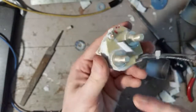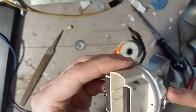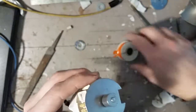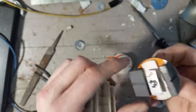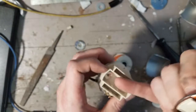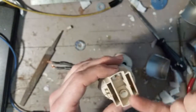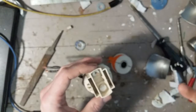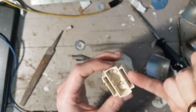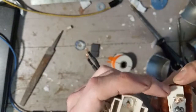Something new I noticed: this little stub pulls vacuum — some kind of gas is in this area, probably simply vacuum. The coil pushes the plunger, and these magnets are magnetic blowouts — they help extinguish any arc that occurs. The arc, having magnetic properties of its own, follows the flux lines of the magnets and gets stretched the long way around. The longer the arc gets stretched, the sooner it'll break and stop arcing. All this happens in a matter of microseconds. That's what the damage looks like — it's pretty severe.